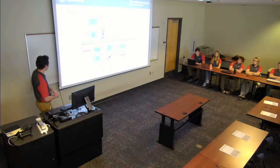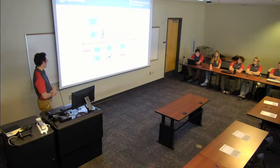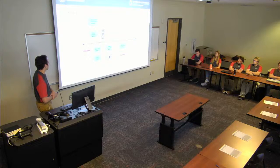So all this stuff on the bottom path is contained within the rocket. So just bridging from here, we have our radio telemetry modem in the rocket. It's a very similar model to this one. It's just a little bit smaller. That allows us to just fit into the rocket better. This connects with an SRAD flight computer, which handles a number of things. It handles data collection, but it additionally handles our communications. So we're receiving these communications here, and then we're processing them in here.